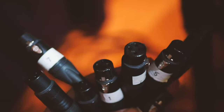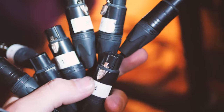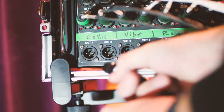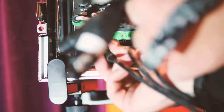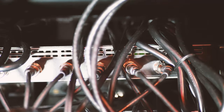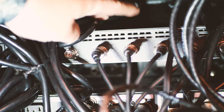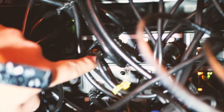Now that we have our antennas connected, we can start making the audio connections between our rack and our mixer or stage box. We have six stereo in-ears, so channels one and two would be for one mix, three and four is another, five and six another, seven and eight is another. Depending on your mixer you can link one and two together so that it's just one control. In the back of the rack you can see our antenna combiner, which has shorter BNC cables that connect directly into each of our in-ear rack units.